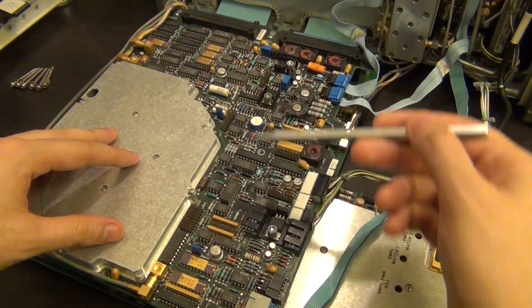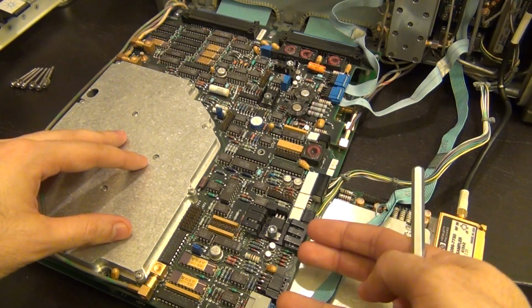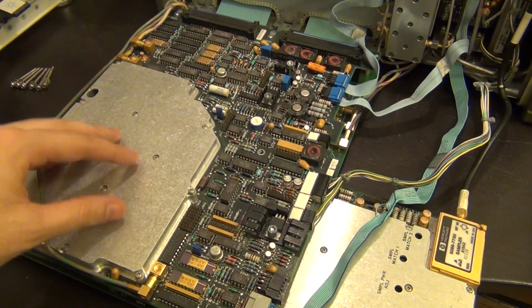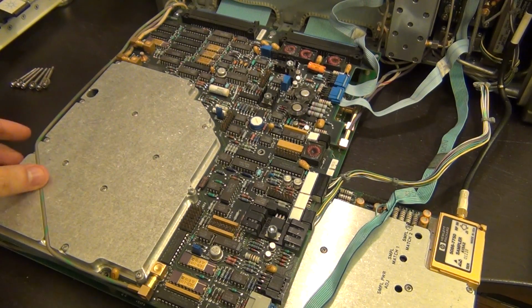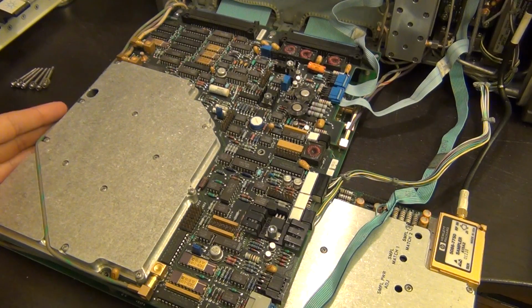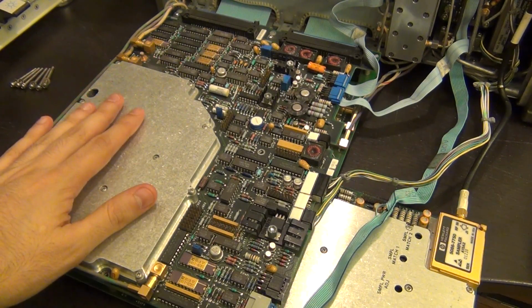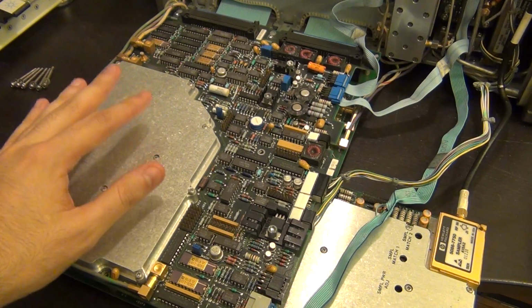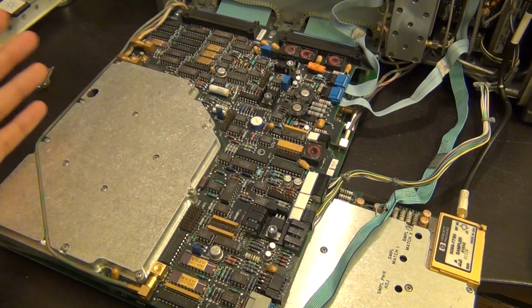So you can see a completely through-hole construction here with all the connectors at the edges, with a couple of different heat sinks, and this is a shielded section. Again, underneath it I think this is the other IF converter, and look, they have a little cutout inside this shield, the top cap, for them to pass the little cable through. So you can imagine with all the cables running around, this is quite a mechanical challenge as well to make sure everything goes together.